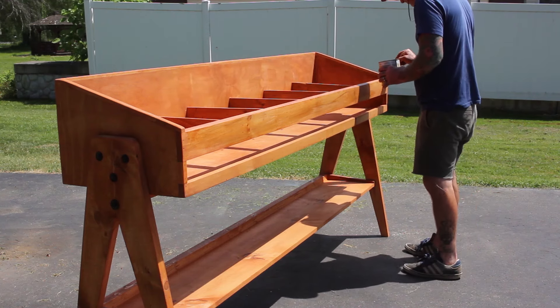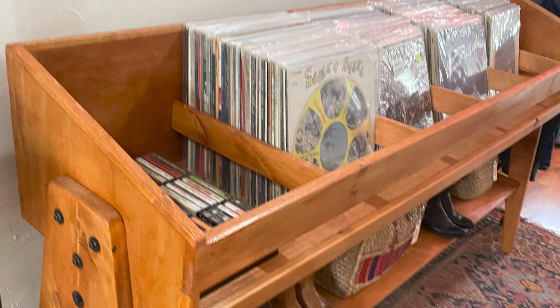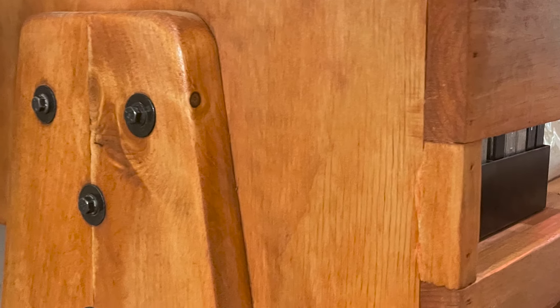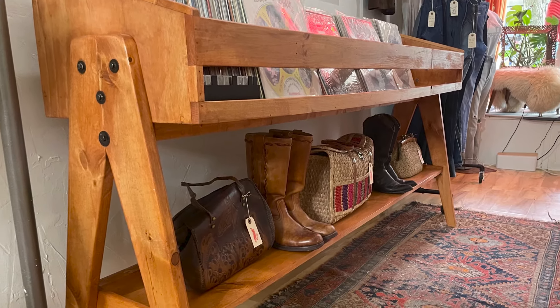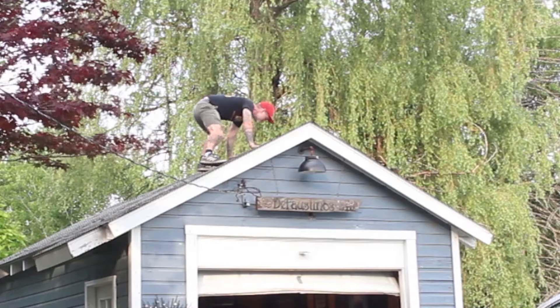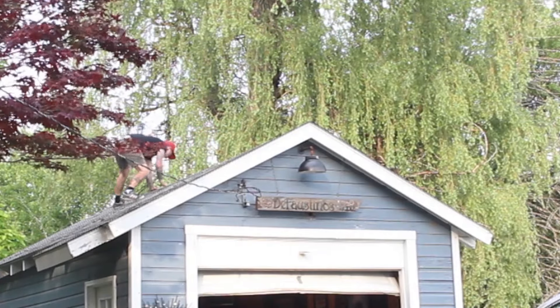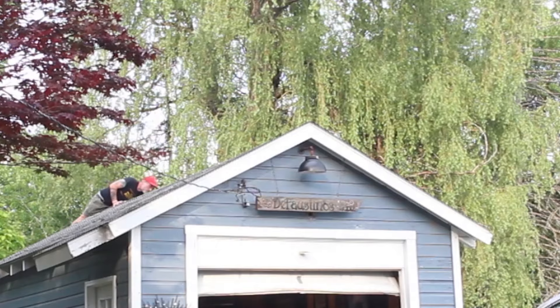This is one of my favorite things I've ever made — I've never made anything in this style, and making something that both comes apart and stays stable when reassembled is not always easy. Four bolts go into each side: three through the cabinet itself and one into the long bottom stretcher to support the weight of the records. Then the shelf sits on the bottom and it's all set. Thank you all for your support and I'll see you in the next one. Bye!